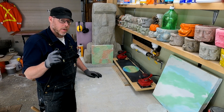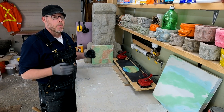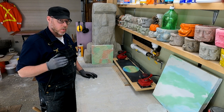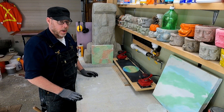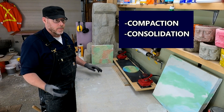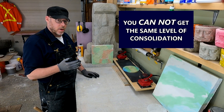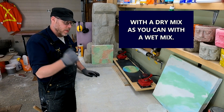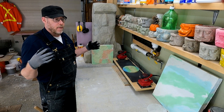Let's talk about the technical reasons why this is inferior, lazy workmanship which will not result in the same quality of finish that a traditional concrete mix and placement will. In a word, if I had to name the one thing that's the real problem here, it's going to be compaction — consolidation. You can't get the same level of consolidation from your concrete material with a dry mix as you can with a wet mix, not even with manual tamping.